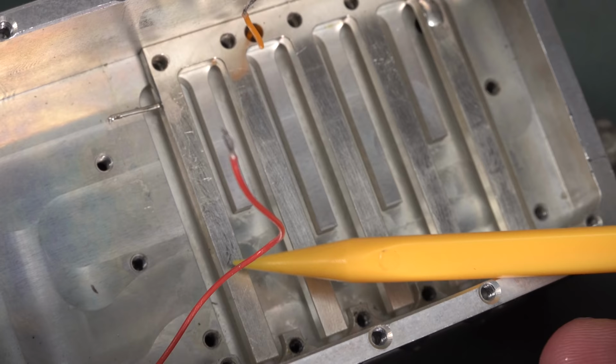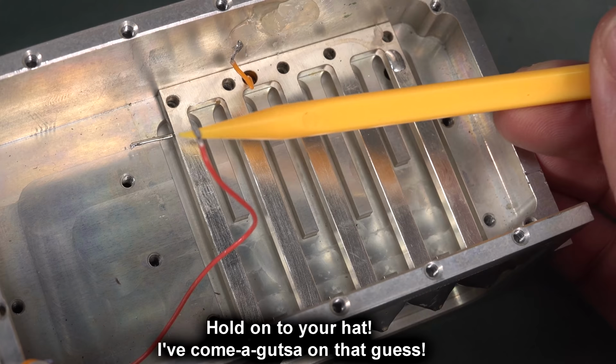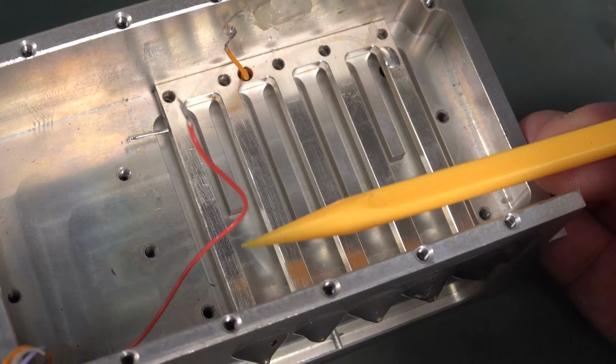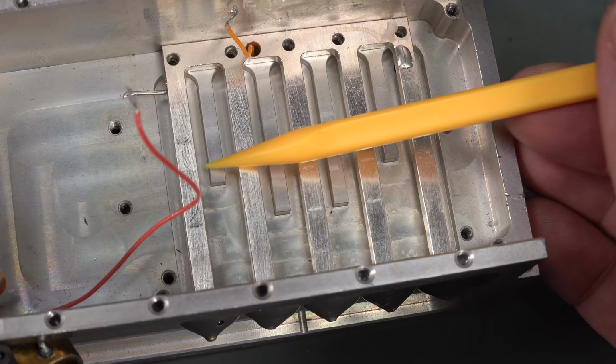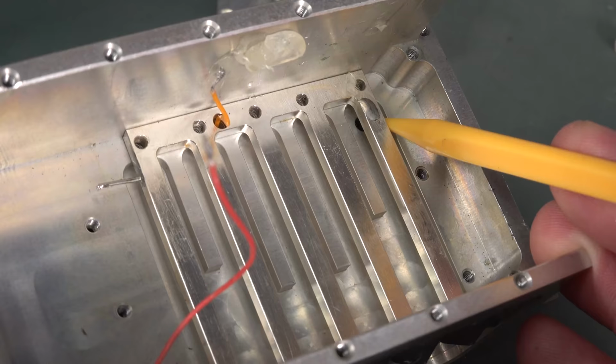So this is obviously some sort of cavity filter. They call it a cavity filter because there's actually a cavity in there. It's an RF cavity filter. I've seen these as tubular coaxial type ones, but look, you can see that each element has a tuned slug inside, so you're able to tune each one. So that's like a 5-element tuned cavity RF filter. Isn't that fascinating? So there you go. That's what's on this side.